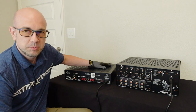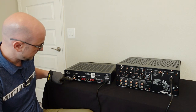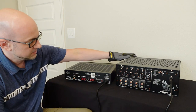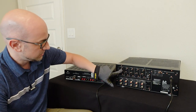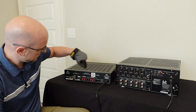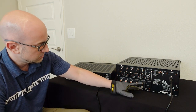First, I just want to explain these amps a little bit. This amp over here on the left is a two-channel amplifier — it has two RCA inputs, one for the right (red) and one for the left (white). This amplifier is a five-channel amplifier — it's got, as you can see, one, two, three, four, five, all labeled. This one has RCA inputs like this one does, but this one also has XLR inputs.